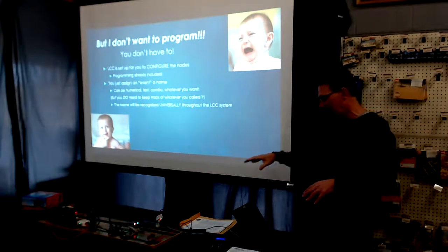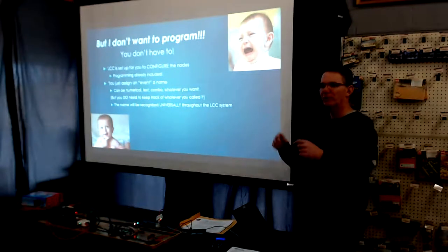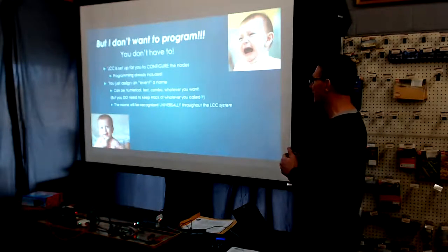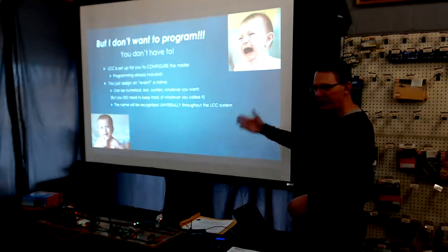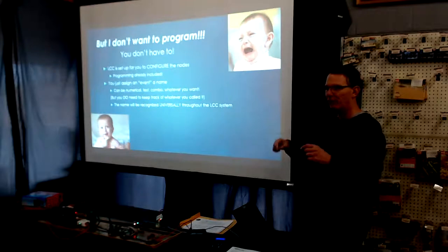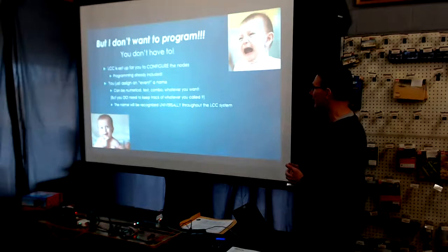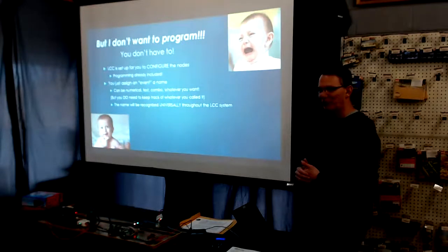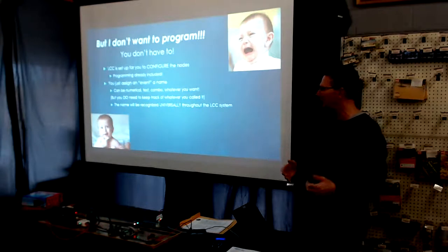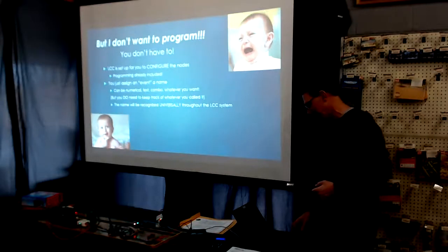So what these LCC folks have done is set up basically all the firmware, so it's really just point and click, drag and drop, and you can set up all your events. And I'm going to show you how to do that. You just assign an event a name. It could be a normal name. It doesn't have to be a dotted number with a lot of codes behind it. You can call it throat switch number one, and that's what it's called. What an idea. But you do need to keep track of it. That's one of the things I did when I first started, I used all these fun names, and then it was like, what was that for anyway? And then that name will be recognized universally throughout the LCC system.